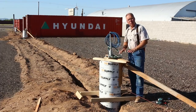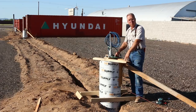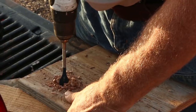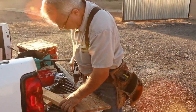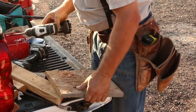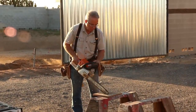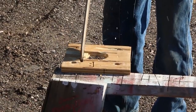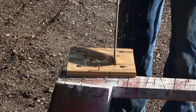There's quite a few things going on here in this little forming system, and as you can see, this is a rough, almost barbaric approach to forming these, but it doesn't matter. The thing that has to happen with a sonotube is it has to be kept dry. If you set up your sonotube form and don't put visqueen over it and it rains that night, don't make the mistake of pouring it full of concrete in the morning, because the paper is going to be soft and the glue will fail and it's going to split out. So you've got to keep it dry.